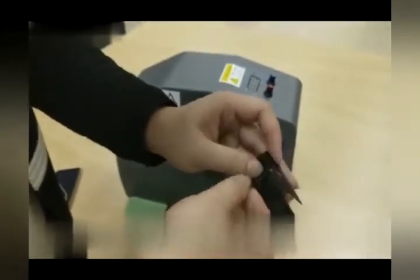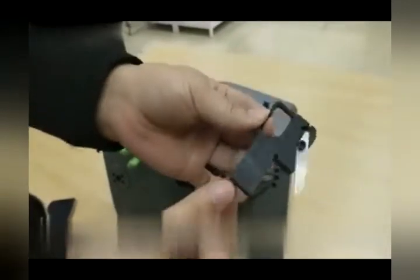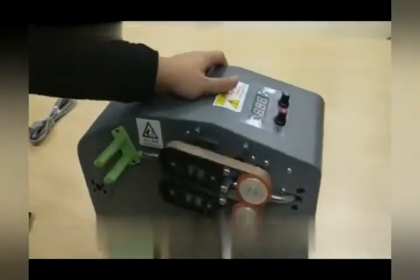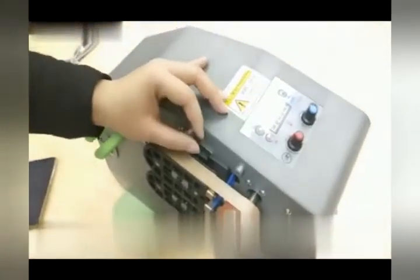Fixture Displays also supplies sealing tape, tape guns, and many other packaging materials — feel free to contact us. Make sure you take a picture before you uninstall the knife, and make sure when you put it back in, it's the correct orientation. There is a very narrow slit in the metal bar — that's where the blade should go through. Do it gently and carefully to ensure it is properly aligned. You can tell by knowing that the subassembly is flush with the body of the inflator on that ledge. Then you can put the screw on again.